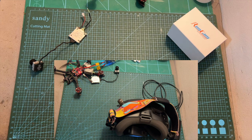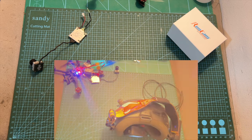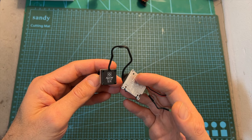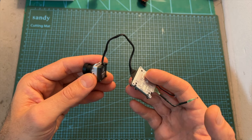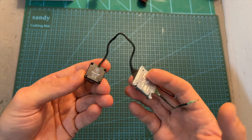In terms of latency, according to my test performed while the Split HD camera was recording and while it wasn't recording, and using both 1080p and 2.7K modes, the added latency is about 30 milliseconds, meaning the total end-to-end latency of the Split HD system is about 60 milliseconds. While 60ms is definitely not suitable for racing and is something you need to be aware of, in my opinion for cruising around and taking cinematic shots it is something that I — and maybe you — can live with.